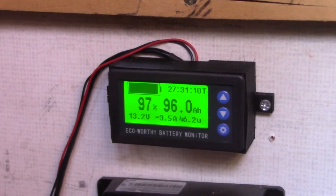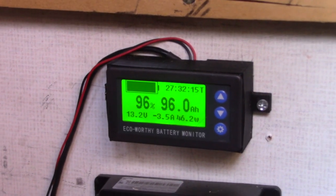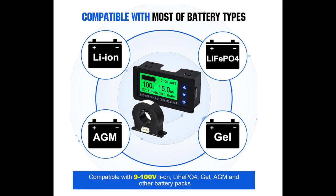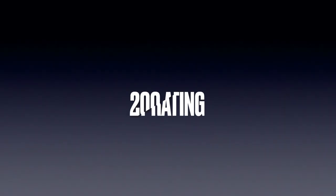I just didn't want to take mine to zero, so there is a second way - through custom programming, which I will show you. One other thing to mention: this battery monitor will work on virtually any type of chemistry - lead acid, lithium ion, lithium iron phosphate, or whatever. I installed mine on lithium, but if you have another battery chemistry it will work just fine. The monitor's Hall effect sensor can handle all the way up to 200 amps. You can also use systems all the way up to 100 volts, so if you have a 24 or 48 volt solar system, it'll work just fine.